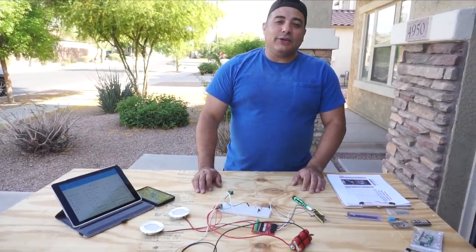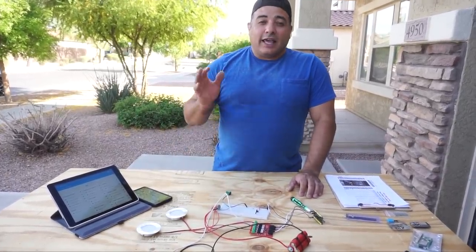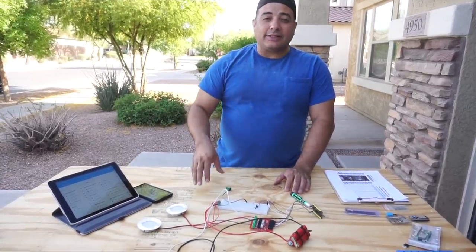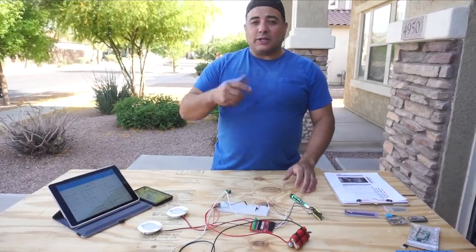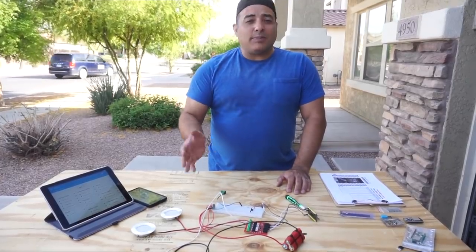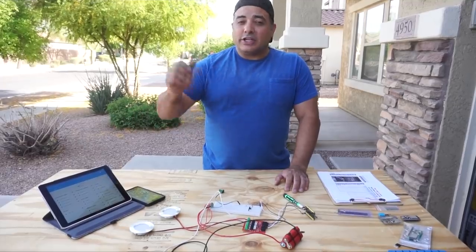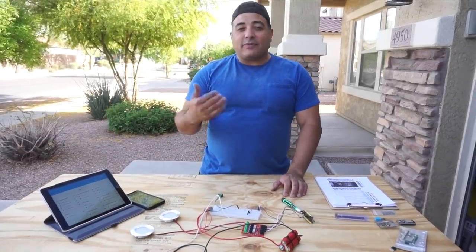The nice thing about using these small processors and MQTT and Home Assistant and stuff is that we can use other switches. The switches that we have that are wired directly into the processors that talk to the lights, we consider to be sort of like a first class citizen of switching the light on and off. Meaning network can be down, MQTT can be down, all kinds of stuff can be down, we can still control the lights. But we may have other switches that are not these first class kind of switches. We may put a switch right next to the sofa that just uses MQTT, and it should work all the time, but it's not the same first class kind of switch.